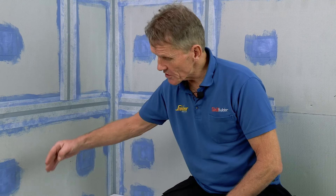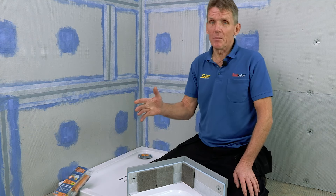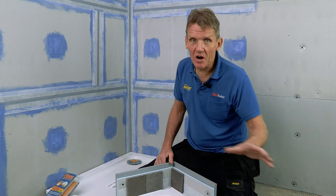There was a solution brought out a few years ago — trays with upstands — but the problem with those upstands is that they had to be chased into the wall, and once chased in you'd actually form a void behind the wall where water could seep, so they weren't the perfect solution. Also, upstands on trays now tend to be on all four sides, which a lot of people don't like. With this solution you can bring the wall down to the floor and don't need to put the tray in until the boarding is done and everything is ready and prepared.